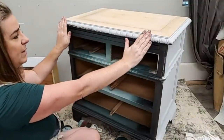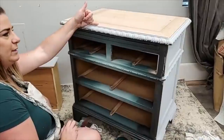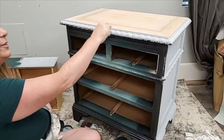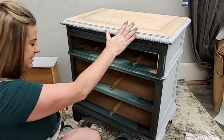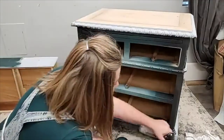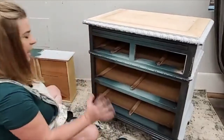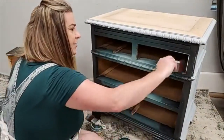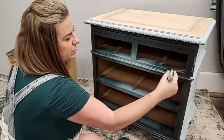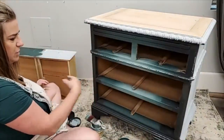I'm not going to paint up to the top right now because I want to go ahead and stain my top first, then tape it off — because my wood runs right up to where I'm going to have a painted portion. I really need to tape it off. I can't sand this wood down again — it's a very thin veneer. The more modern your pieces, the thinner your veneer is going to be. These are probably from the 1990s — not a very thick veneer. I need to make sure that's protected so if I get paint on it I can protect the wood.